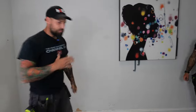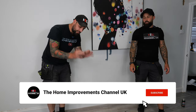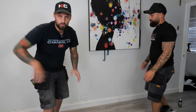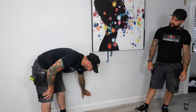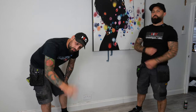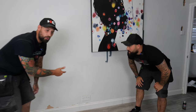A couple of things to note: you're going to get a gap on top unless you've got an absolutely new building — don't worry, you're going to put decorator's caulk along the top after; just get it as close as you can. Also, remember fixings like sockets: don't put your nails in there because cables are likely to run straight down, up, or across. Avoid pinning below any sockets or light switches.